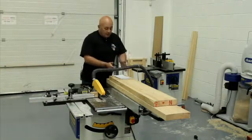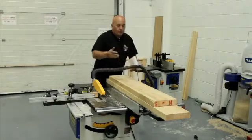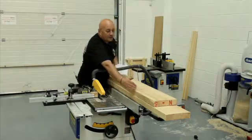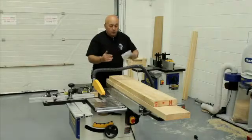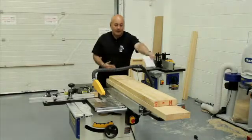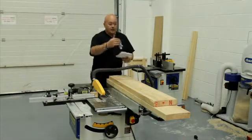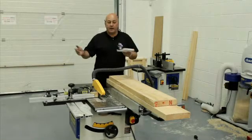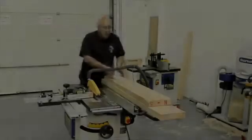You've really got to do this at your cutting list stage, that you look at what you're going to cut out of the timber, where you're going to look at what piece is going to be what, how long it's going to be in relationship to that piece of work you're doing, and therefore that will then give you, hopefully, a situation where you can cut it off to a specific length, rip it to size, machine it, and then you can then redimension again after to component sizes, and then go on to your marking out, and then onto your machining for your joints.